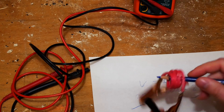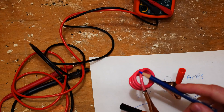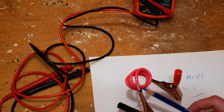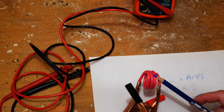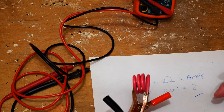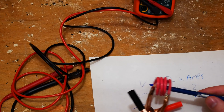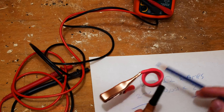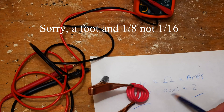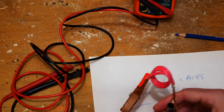The reason it's such a dead-simple design is that I was calculating wire volume for my shunts, and it just so happens that 1000 feet of 10 gauge wire is 1 ohm — or a tenth of a percent off from an ohm. So a foot and a sixteenth is exactly 1 milliohm. That's it — it's that simple.